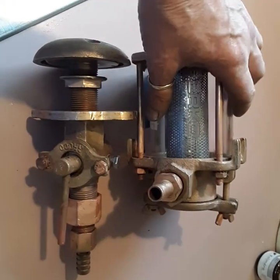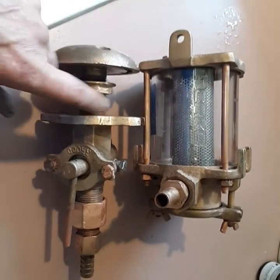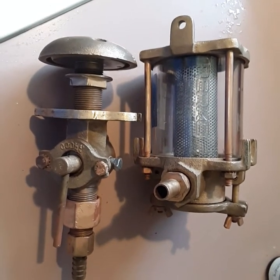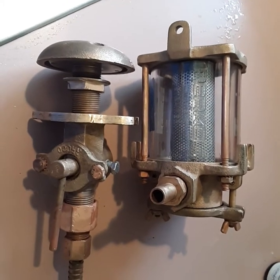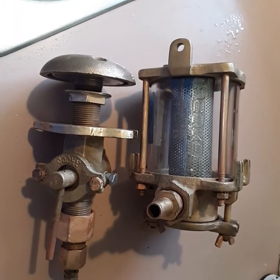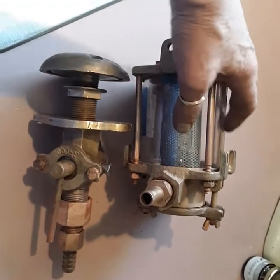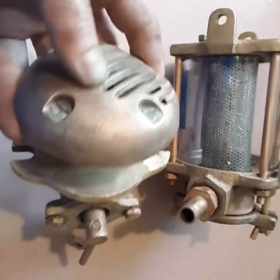I probably am going to leave the strainer out until after I do the engine work. I will put in the thru-hull fitting. I'm not going to mount the valve, just do the thru-hull, because I'm probably going to pull the engine, sandblast the outside, get all the scale off of the outside of the motor, and I got some new Yanmar silver to spray on the outside of the motor, and get it all cleaned up, and get that well underneath the engine cleaned up, look at the motor mounts, see if they need replacing, and take a look at that stuffing box, see what I need to do there. And get that bilge pump position down in that really deep part of the hold as well. So I'm going to work on all that while the motor's out. So these items will probably stay out of the boat for a while where they're safe, now that they've been cleaned up.